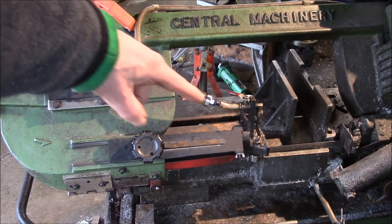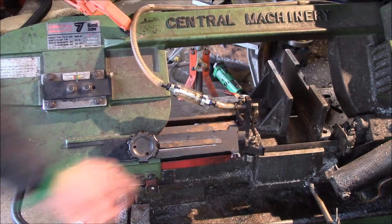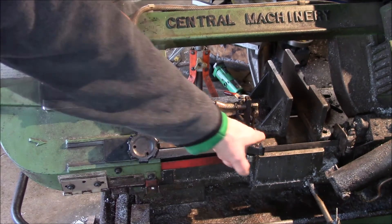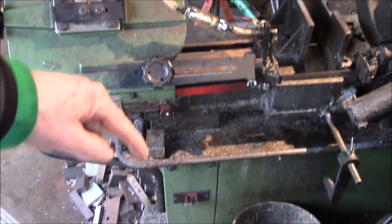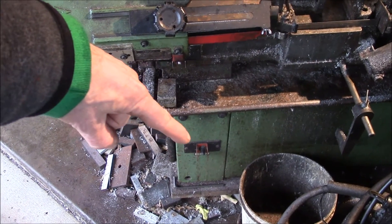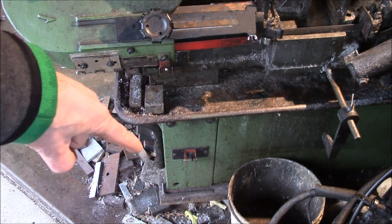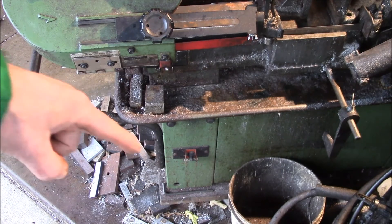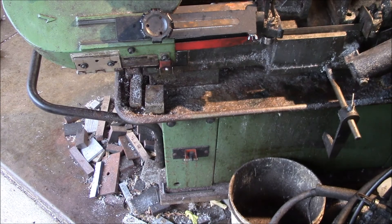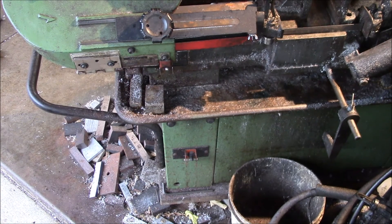The other thing it has is a coolant hose that feeds coolant in. There's a small copper tube that drops coolant onto the blade when it's running. Down here there's a separate power switch — that's the main power switch for the saw — and when you turn the coolant pump on, the pump turns on and off with the saw power. I use the coolant mainly for sawing steel, and sometimes aluminum for big cross sections, but I turn it off for sawing plastic, which I do a lot of.